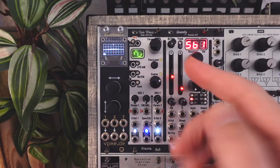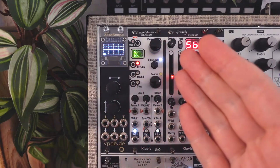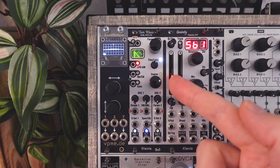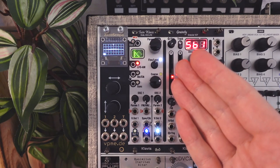When you put an oscillator in LFO mode, the front panel and features change a bit. This knob is still used to select an algorithm, and again, each algorithm has one modulatable parameter. The large knob controls the frequency of the LFO, but the small knob controls the output level of the LFO, so you don't need an external attenuator.